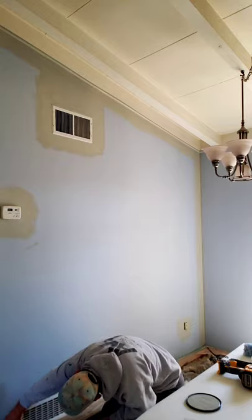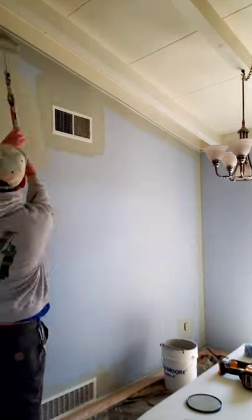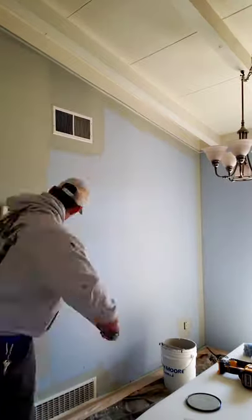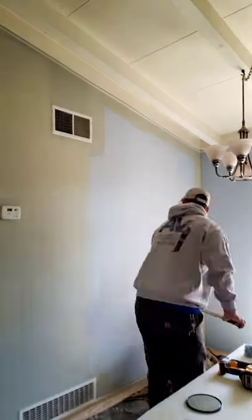And I brush out of that as well. That way, after I cut in, I can use the mini roller and lightly roll over the brushed area. This will allow the stipple of the roller to blend with your cut lines and make for a supreme professional finish.